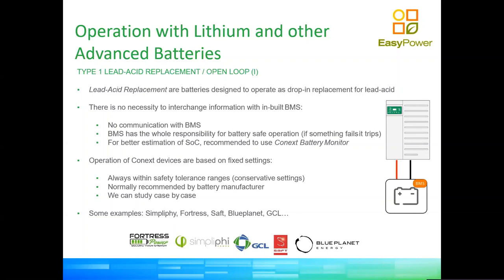Even if you charge a battery full to the brim, the BMS will self-balance the cells to a point where they are a little bit below full. So you are never going to get to full. The kilowatt hour calculator is calculated to the point at which a BMS will land after it has balanced the cells below the stress point. Because of that, the battery will not benefit from float charge, okay? Therefore, the way we operate with these batteries is with the inverters on a two-stage charging model. We do use the solar chargers on a three-stage, purely because the solar system will use the three-stage as a way to keep the solar charger on, but it will not overcharge a battery.